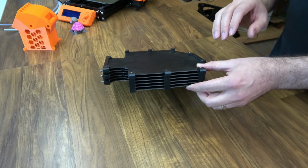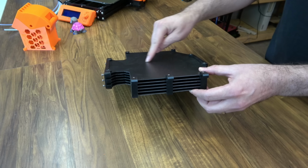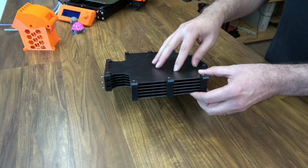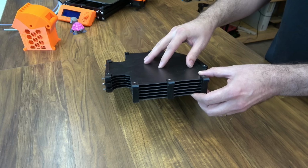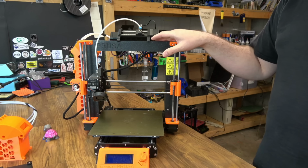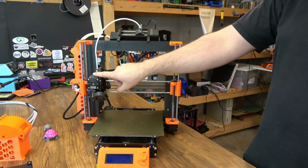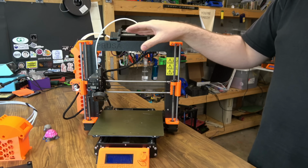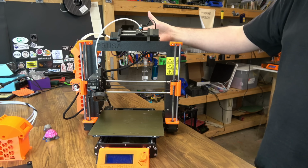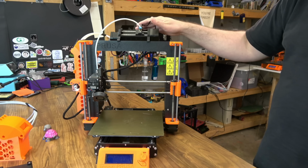And when you're not using the filament, it's actually going to have a big loop of filament inside here. That's because it's hard to automate putting it back on the spool when it's not being used by the printer. And those that aren't familiar with this process, basically we have one nozzle, multiple extruders. The MMU2 just feeds it down the Bowden tube to the direct drive gears, and it does this with each one as it needs it. So you're pulling filament off the spool from the back, pulling it down to the drive gears, using it, and then you're putting it back.